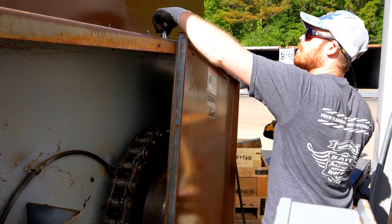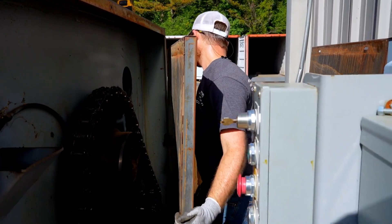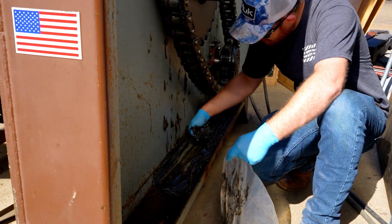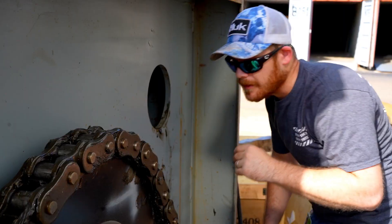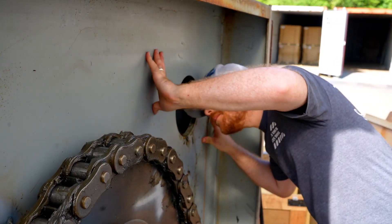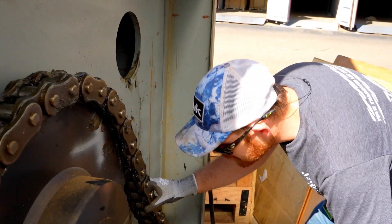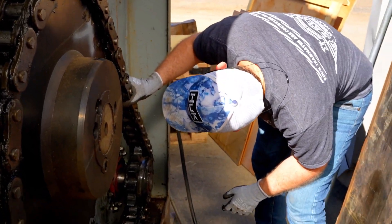The following is our recommended preventative maintenance that should be completed every quarter. Step 1: remove the cover with an impact drill and a 9/16 socket. Then clean debris from the chain or the sprocket chamber. Step 2: inspect the rear bearing cover for grease leakage. Perform a visual inspection of the shaft between the sprocket and rear bearing cover, and the area directly behind the rear bearing cover, for grease leakage.